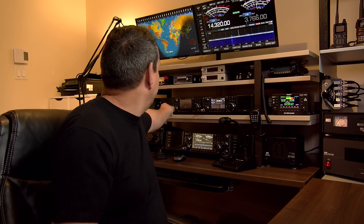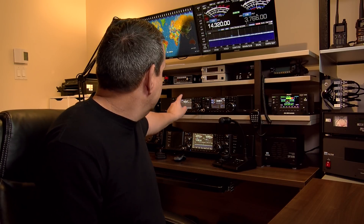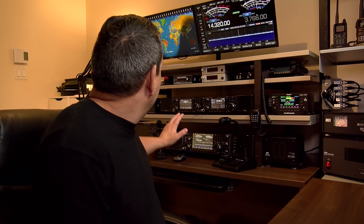As an additional precaution measure, you can see here I have the IC-7300. I don't use six meters very often, so I always set the radio to six meters before I shut it down. Why? Because if I use another radio, I think that when you select the bandpass filter on a band, it might offer some extra isolation — though I'm not sure if that does anything when the radio is turned off. I'll have to ask a radio manufacturer. If you know, go in the comments below. But I usually work on 40, 80, and 20 meters, so I try to leave the other radio on a band as far away as possible. It's just another precaution measure.